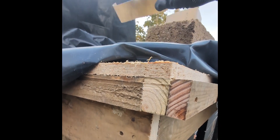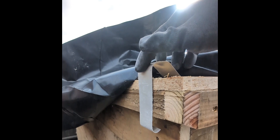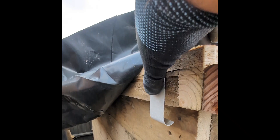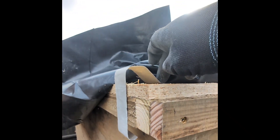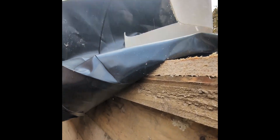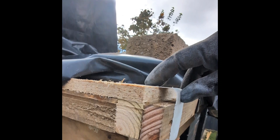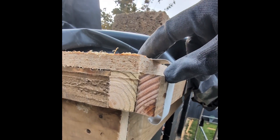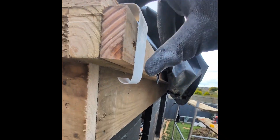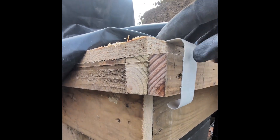So let's see how those trims look. Here we've got a side profile, and you can see it fits there nicely. You've got a bonding point there, you're going to nail it at the top, and it comes down nicely. Now for the front drip trim, you can really see the purpose of dropping the second batten down is to avoid the curve, and there's a good distance there so water will drip nicely into our gutter.